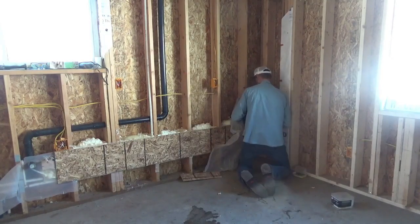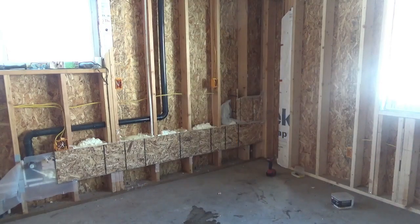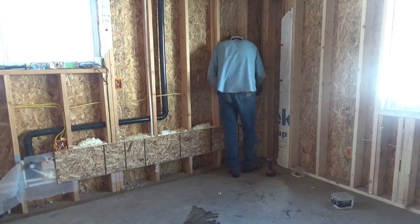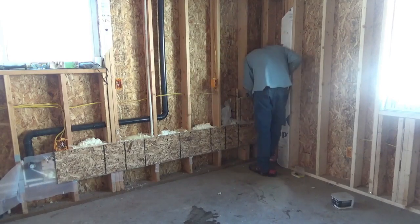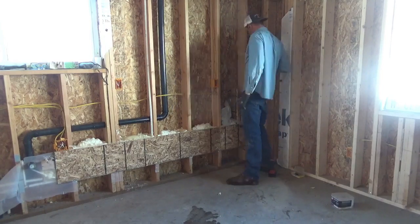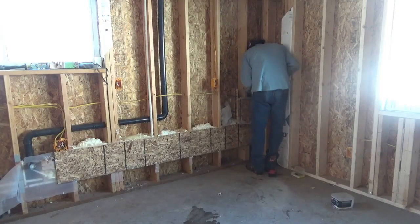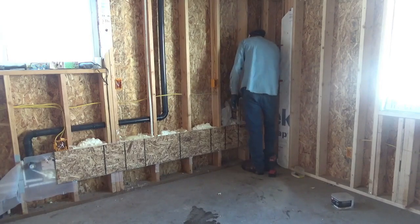I tried to get both the house and the cans of insulation as warm as I could before doing this. The weather looks beautiful the rest of the week. I'll get back up here on Monday, pull these forms off, and take a look at how it turned out. The spray foam is basically done — I may have to add one more can, but it's better to watch and see how this stuff expands out before putting another can in.